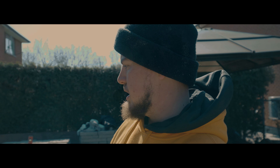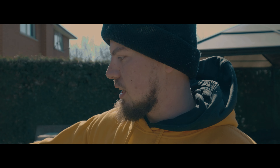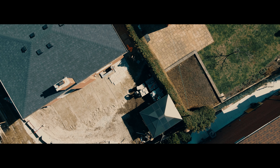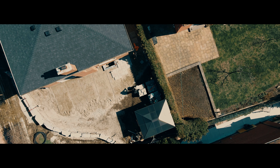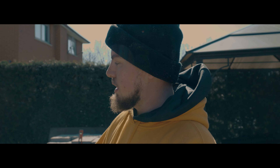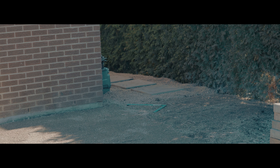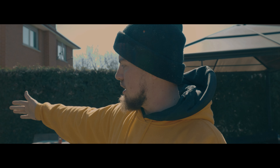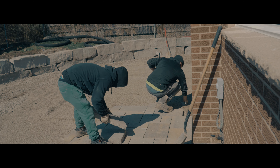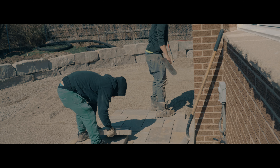The game plan is dictated by the fact that we cannot step on the grade once it's done. Once it's graded like that, if I step on it, it makes a little divot and then the stone divots as well. So we have to plan around laying the stone without damaging the grade. We left a little ungraded section where the stone is staged, so we'll bring it over the ungraded section and lay. Then as we keep laying, we step on the stone already laid, lay the next one, and so on — we never actually step on the grade.